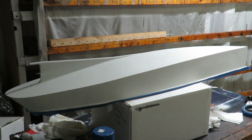Okay, now we have three coats of primer on. We sanded fairly lightly before putting on the second coat, after the first coat. We have two coats of varnish, and then sanding, and then a coat of primer and sanding, and then we added two additional coats of primer just for building more thickness. And now, this is an interesting step. This is optional, but it can improve your finish.